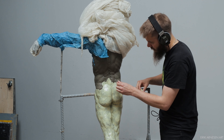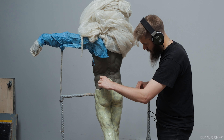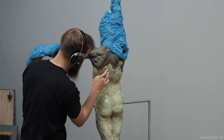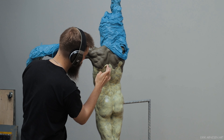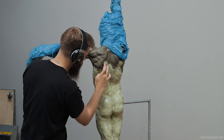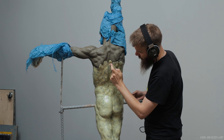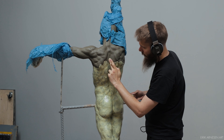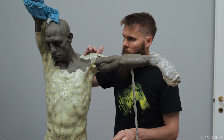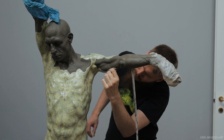The first layer applied on this sculpture took me alone about 8 to 10 hours to apply, and the subsequent second and third layers where I had help took about 8 hours each — so it's a lot of work. The silicone is mixed by hand. It comes in a 5kg bucket with 5 tubes of catalyzer per bucket, so 1 tube of catalyzer per 1kg of silicone. The mix ratio is very forgiving, so I just mix by eye — I have enough practice to know what the color of the silicone should be once mixed properly. The yellow catalyzer I'm using here sets up within a few hours if catalyzed properly. There's also a pink fast-setting catalyzer which I'll talk about later in the video. I always apply from bottom up because the silicone needs to be dipped in water to stop it from sticking to my hands, and if I go from the top down, water will run from my hands and the silicone down onto my clay surface, making it soft and wet and very vulnerable to being damaged. So applying from the bottom up ensures this doesn't happen.